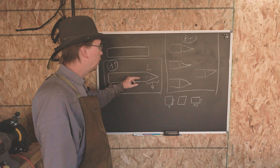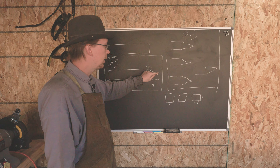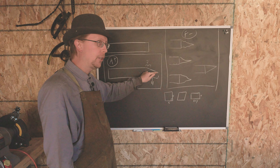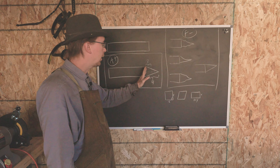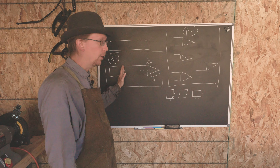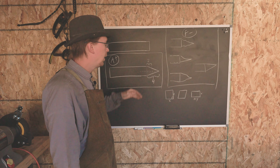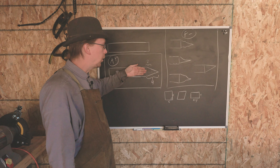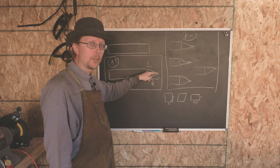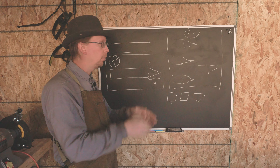What I'm really looking for is that this point has nice even sides coming to it, very flat, that there's a clear transition between the end of my taper and the start of the rest of my bar. There aren't any stray hammer marks or fuzziness to that, and if I rotate this bar, this point doesn't waver — it is dead center, and as I flip it around, I'll be able to see that.